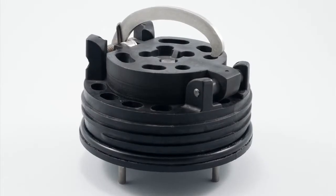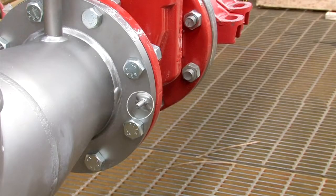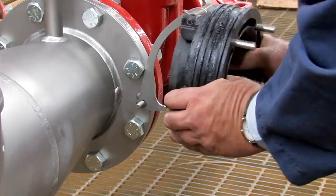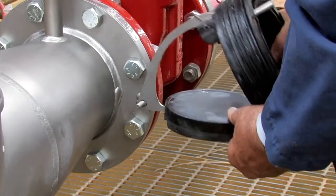To open and inspect the checks found in the 6-inch assemblies, first slide the cam arm over the opening stud on the outlet flange. Gently pull the arm back and lock the check open by placing the arm against the notch found on the check clapper.